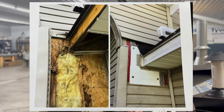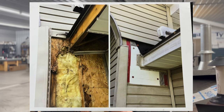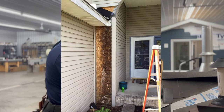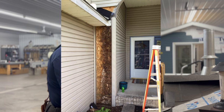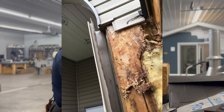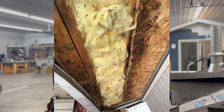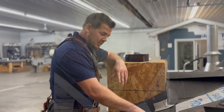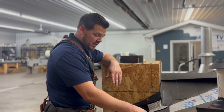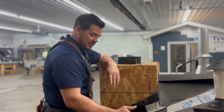Right here is a great example of why kick-out flashing is important. As you can see down the wall, water was able to get behind the siding and actually rot out that OSB — it just crumbled and fell to the ground. The insulation was all wet and there was a little bit of mold on the studs. This is an instance where kick-out flashing was not used, and then later they tried to install kick-out flashing, but it was too late.